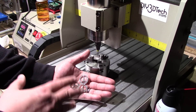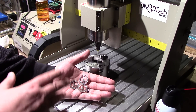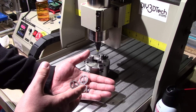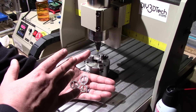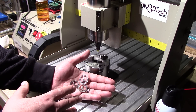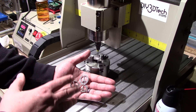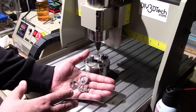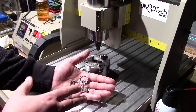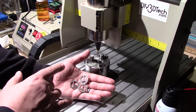I want to talk about a couple of things. As mentioned, I went with a 2.4 millimeter instead of a 1.75 bit — same type of bit as far as fluting. I slowed it down to about 2 millimeters a second with the same cut depth of 0.1 millimeter. That worked pretty well. I still think there are issues with acceleration — I need to accelerate slower, so I'm going to look into that. The other thing I did is I changed the cut depth to make it deeper.